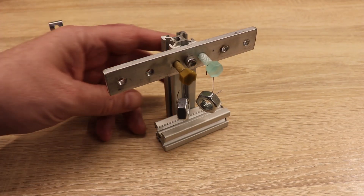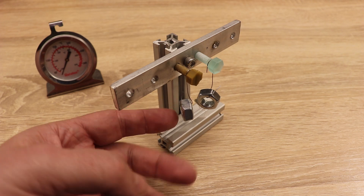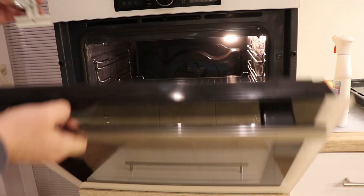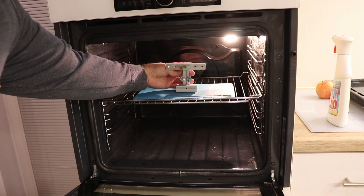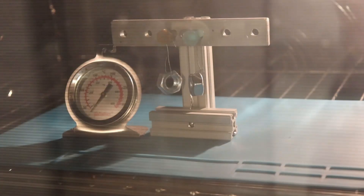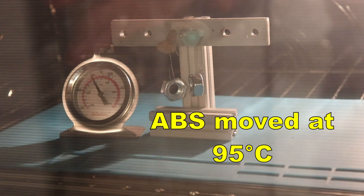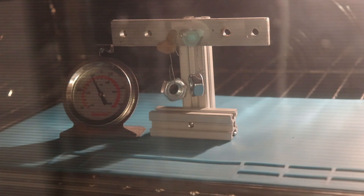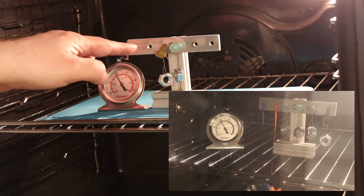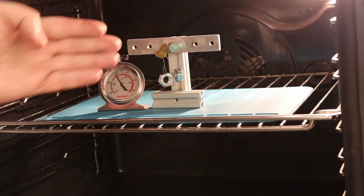This is my temperature test setup. The bolts stand out exactly 15mm and I attached M10 metallic nuts as additional weight. I measure the temperature with a thermometer. At 150 degrees Celsius I will stop the experiment here, because last time going up to 200 degrees made it very hard to pull out the melted filaments from the holes. But it's obvious who is the winner in this experiment.